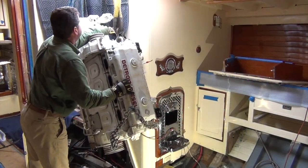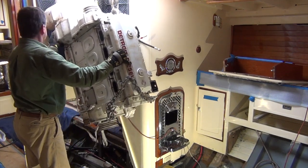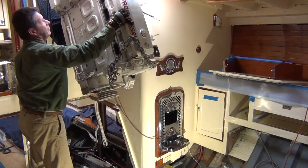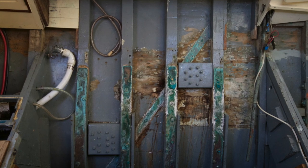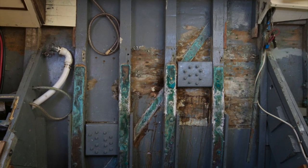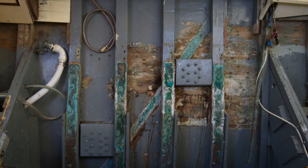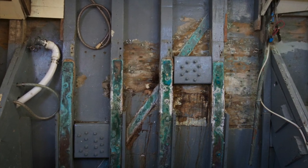In 2002, Chabasco was coated with multiple coats of epoxy in an effort to slow down the deterioration that had been going on since she was built. Before the advent of epoxy resins and epoxy barrier coats, seawater, through pressure and osmosis, could pass through the coatings, completely saturating the wood.